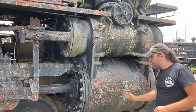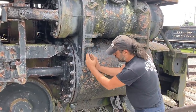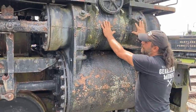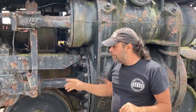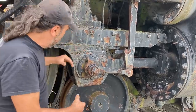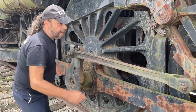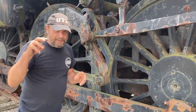Here are the pistons. You've got one on this side and one on the other side. The unique thing about a steam piston is it's powered from both sides. When the piston is here, steam is forced into the chamber and the piston moves back; when the piston gets to this point, steam is forced in and the piston moves back again - so this thing is powered both ways. This valving here coordinates that steam to keep everything moving back and forth. On this engine we're missing the main connecting rod - the driving rod. Here's the equivalent of the wrist pin area on a regular engine, and from here you have a rod that would come to the wheel. These connecting rods tie the wheels together - the same exact concept as you have in an internal combustion engine.